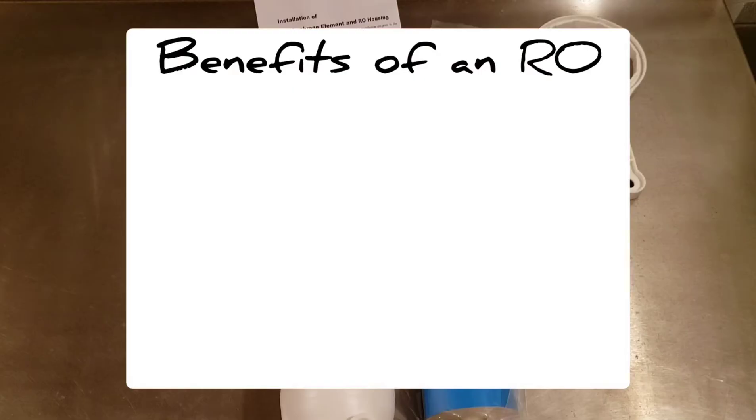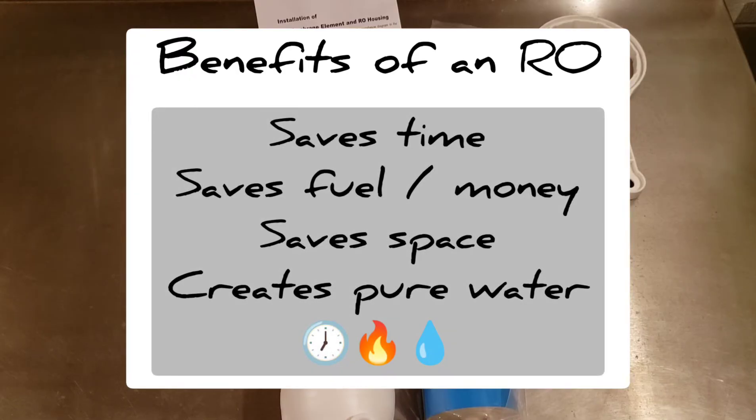What are some of the benefits of reverse osmosis for the maple syrup producer? Number one: processing sap through an RO leads to a lot less water to boil out of the sap. Since you're starting with a higher sugar concentration on a volumetric basis, you're going to have a lot less boiling time and fuel consumption. I've been able to effectively reduce my fuel consumption and boiling time by at least one half, and in some cases on my most advanced unit, up to one fifth. If you use wood, you'll gain back time cutting, splitting, and stacking. If you use natural gas, propane, or fuel oil, you're going to be cutting those costs significantly.